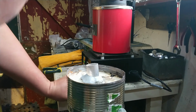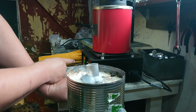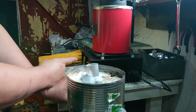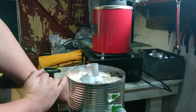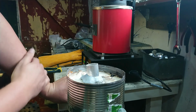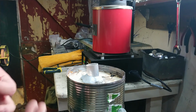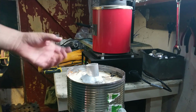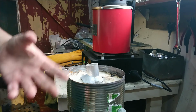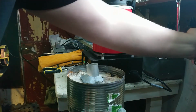One of the things I think I made a mistake in last time, as well, the thermostat here said 1076 Celsius. I think the problem is that the temperature sensor is at the bottom of this. Now that could indicate that it's much higher temperature at the top, but I poured pretty much as soon as it hit that temperature. It might have been that the actual body of metal hadn't reached that temperature yet. So I'm going to wait a little longer this time and just let everything come to sort of a normal equilibrium. I'm going to hang up my shifter while I don't forget.